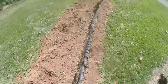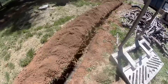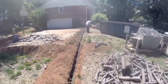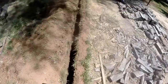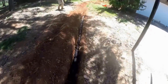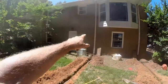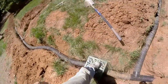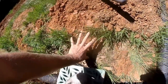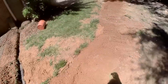Here's our trench with our installed yard drain — actually this is called a yard drain, not a French drain. French drains have gravel and perforated pipe; this is all solid pipe. It comes from the downspout under the drive — you can see our PVC pipe up here. Connection here, this is coming from the back, comes around, runs all the way back. The guys are starting to cover. Paul's covering up the back, making quick work of it. We've got our downspout and T picking up the roof, coming down, picking up more downspouts. We've got a catch basin in the low spot. It may look high here, but this is actually grade — we're about four inches below grade right here, so when we backfill it'll really drop into the system. Covering up the rest of it.